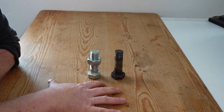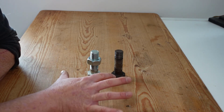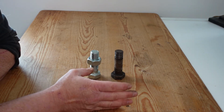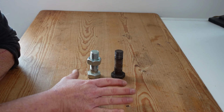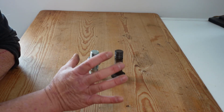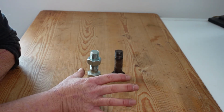Generally speaking, while it's not an industry standard, it is sort of recognised that normal working torque is classed at the operation of that impact tool for 5 seconds. Maximum working torque then is at 10 seconds, and then maximum torque is 15 seconds. So obviously if you need to spend 15 seconds tightening every fastener, this is a significant impact on time, okay? So just keep that in mind.